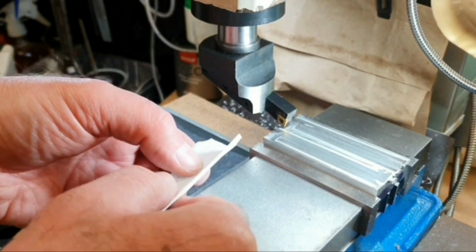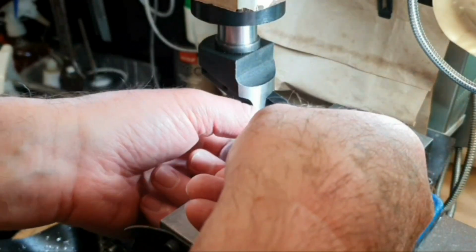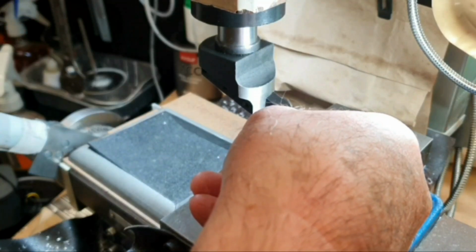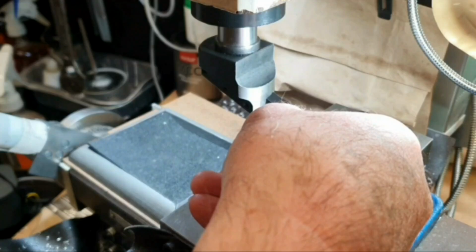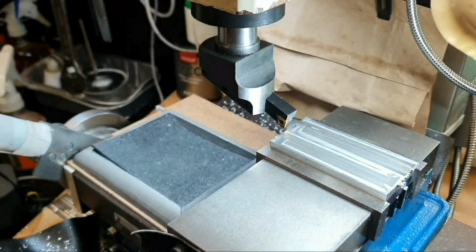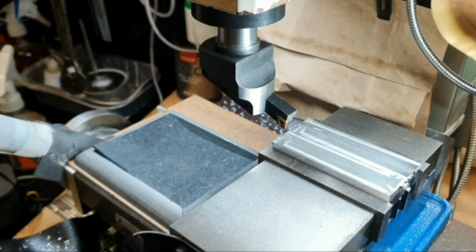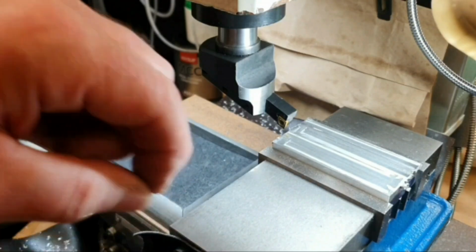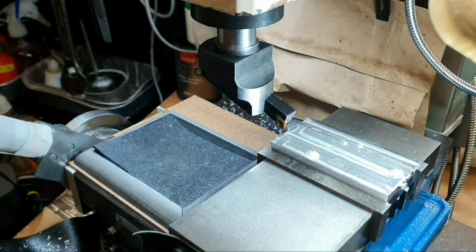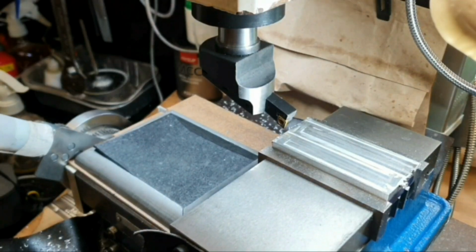So I'll bring the tip of this fly cut, which has got a little carbide tip, down until that touches, then I can make a cut. That's it. That's touching the surface, so we can wind that off, and we'll put a cut on. See if this pass will actually clean up or not. Bit of WD-40 on there. Spread it around a bit. Okay.